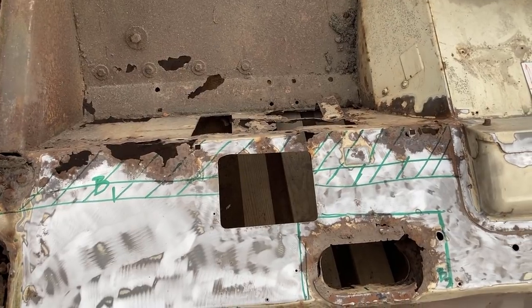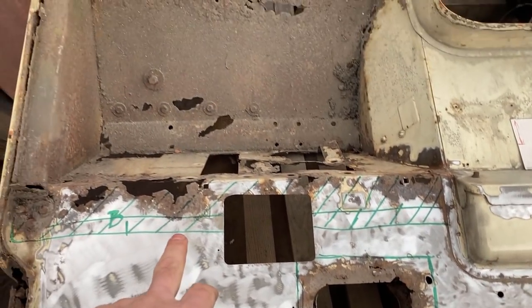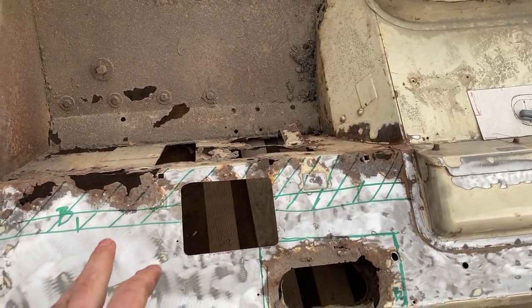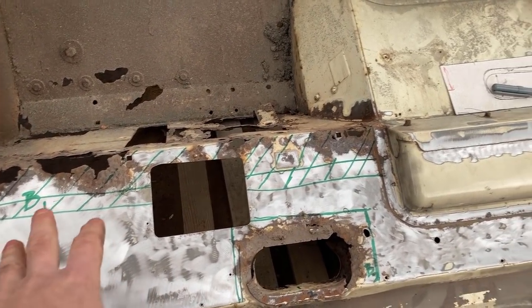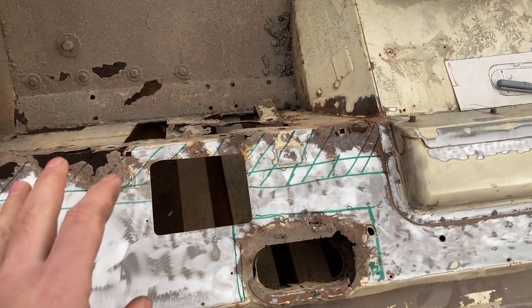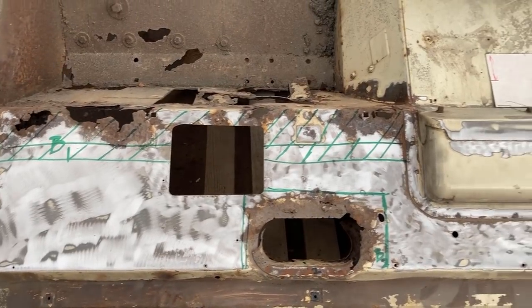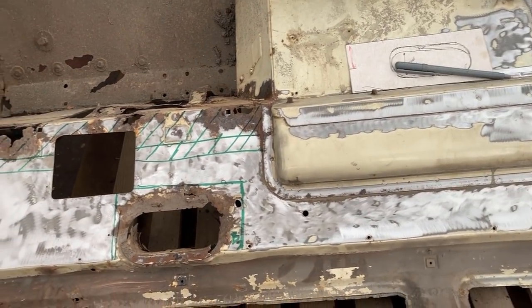Anyway, I'm just weighing up, trying to get myself a sort of sequence of events or patches. So I've decided to do the inside face of the bulkhead first. Reason being, there's less complicated bits to work around and none of them are available to buy. Which means I get to chop up some bits of steel and weld them in.